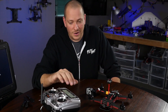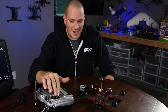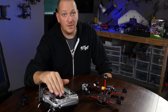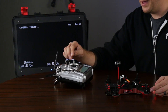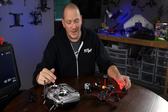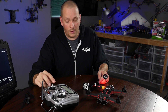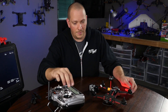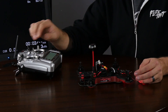Let's see if we can arm this — down and to the right. And it does. Down to the left disarms it. We're going to arm it one more time and make sure all the controls go the right way. When we bank to the right, we want the left motors to spool up — and it does. Bank to the left. Forward, we want the back motors to spool up. And then for yaw right, we want the back right and the front left to spool up. That's good to go.